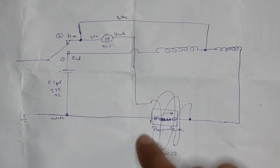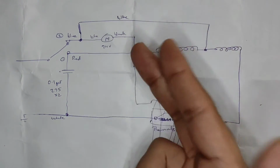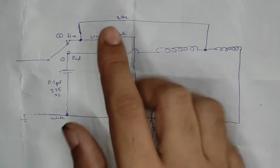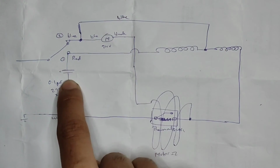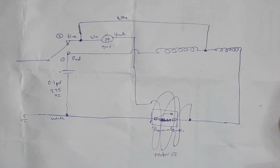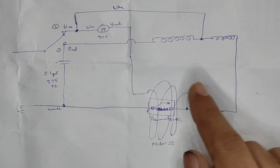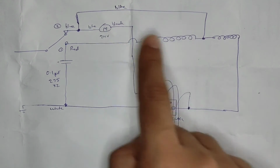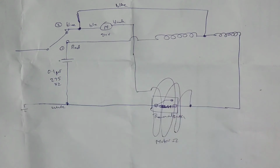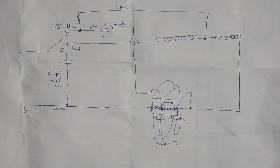And let me explain that this resistor here is actually used as a series dropper. They could actually use a smaller transformer to reduce the input voltage down to 24 volt, but that is not necessary. They could also use a capacitor dropper to bring the voltage down to 24 volt. That is not necessary, because this is not designed for any kind of efficiency. This is designed to dump the energy in the form of heat. So they don't have to care about producing heat or wasting energy, because while in operation, it is supposed to get hot anyway. So why not provide it with an extra boost of auxiliary heating with a pair of coils that can also act like a series dropper resistor? So that's the way that they found to get it done.